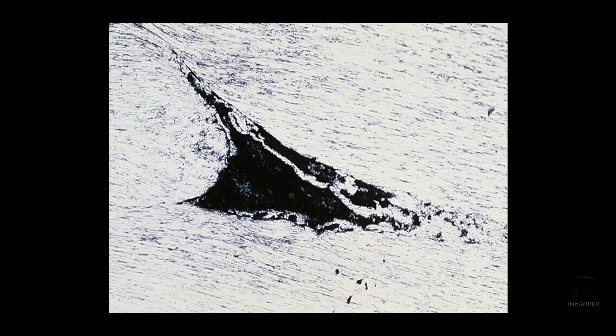Once this starts, you don't get a wire break immediately. This crack on a 45-degree plane might take a large number of dies before it breaks into two parts. For ductile materials like copper and aluminum, it might take as many as a dozen dies before the crack becomes big enough to break into two. For a hard material, the crack can propagate more easily, and it might only take a few dies before it breaks into two pieces.